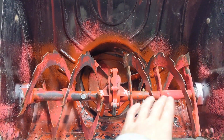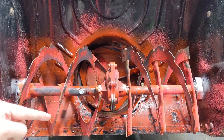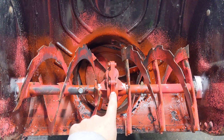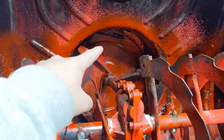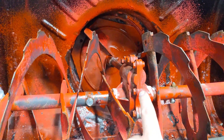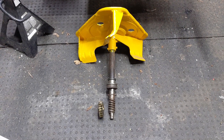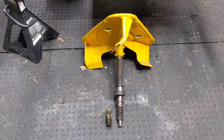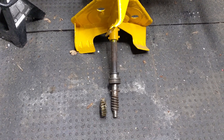Here is your main auger — these are the auger fins and they slide over a shaft that is connected to the gearbox. In behind the gearbox is your second stage, and the second stage is connected via a shaft to the gearbox. I have in front of me a second stage and main drive shaft from a Cub Cadet, along with a worm gear that it meshes on.